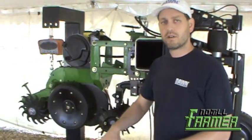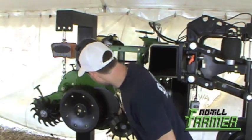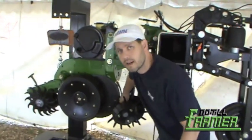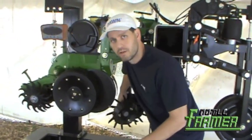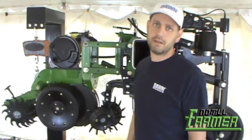The hydraulic cylinder throughout its stroke of travel, the pressure changes very minimally. Once we engage the ground, the row cleaner is allowed to float around that pressure rather than trying to set a depth, which is very irregular in the field.